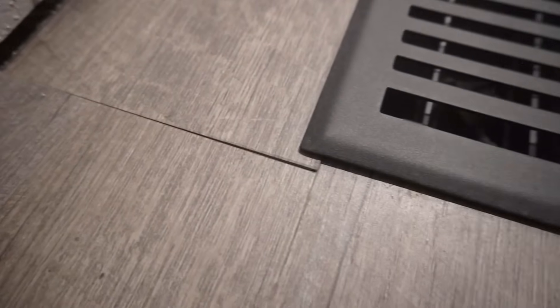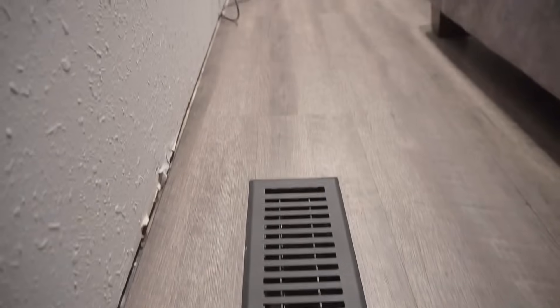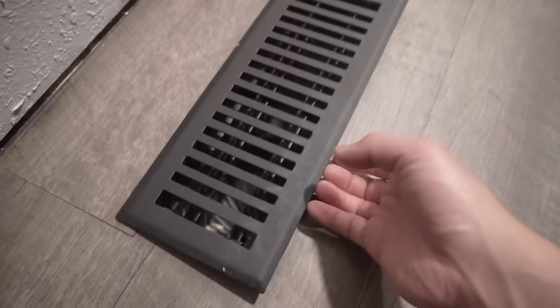Here in the Pacific Northwest we have four seasons, meaning that the temperatures go from high to low. Being the location of this damage on my flooring, it is near a vent system and I have heating and cooling inside my home that runs all year round. So no matter how much you prep around this flooring, how much you make it even before you put the flooring down, it'll eventually start warping and expand and contract because your subfloor is made out of wood.